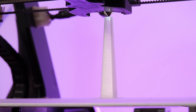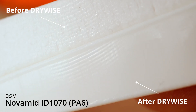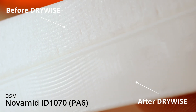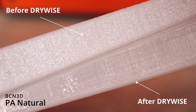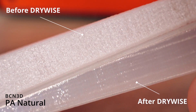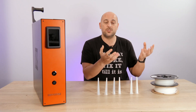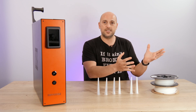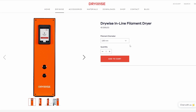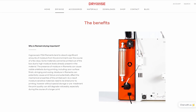If you're a maker, this machine is not really aimed at you — you'd buy a food dehydrator instead. But commercial companies already spend seven, eight, or ten thousand euros on machines like a MultiFab or a BCN3D, so Drywise is relatively low cost by comparison and will save them a lot of time. Instead of throwing a 2.85mm spool — potentially a 2 or 3 kilo full spool requiring 30 to 40 hours of oven drying — you can start printing within an hour. Thought3D have also confirmed they are working on a 1.75mm version, expected in beta later this year around Formnext.